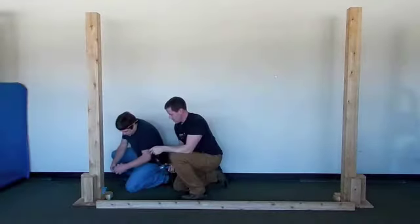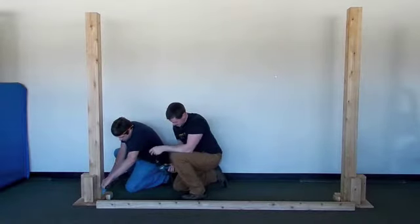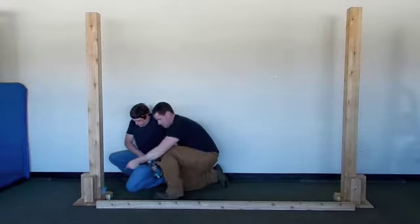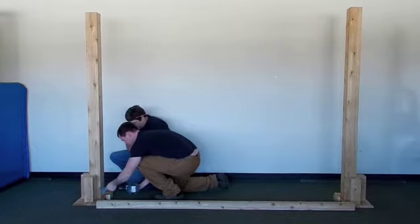Also, when starting to install your first panel, make sure that you're installing from the highest point of your property. This will help you step the panels so that your job looks more consistent.